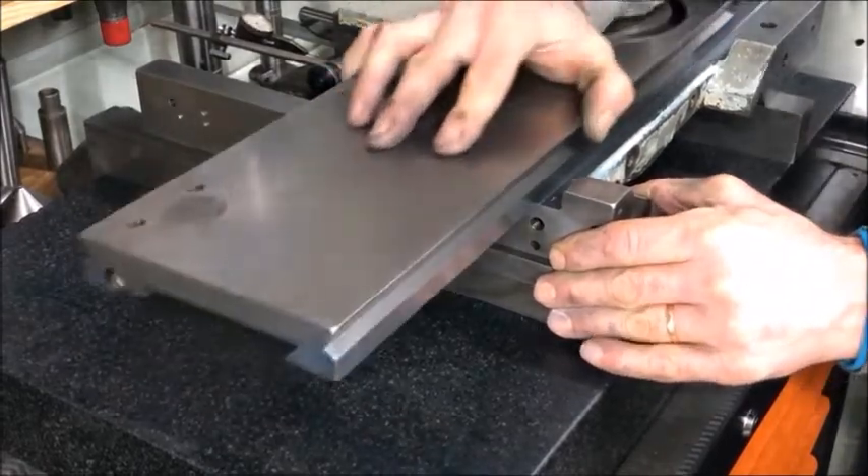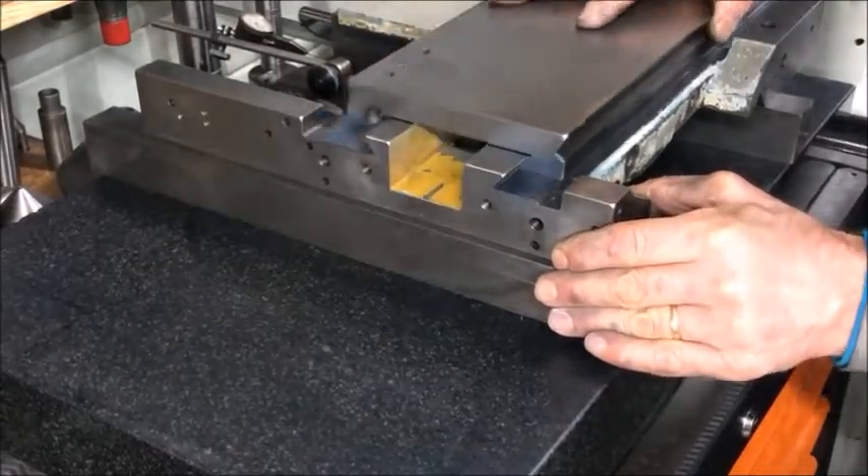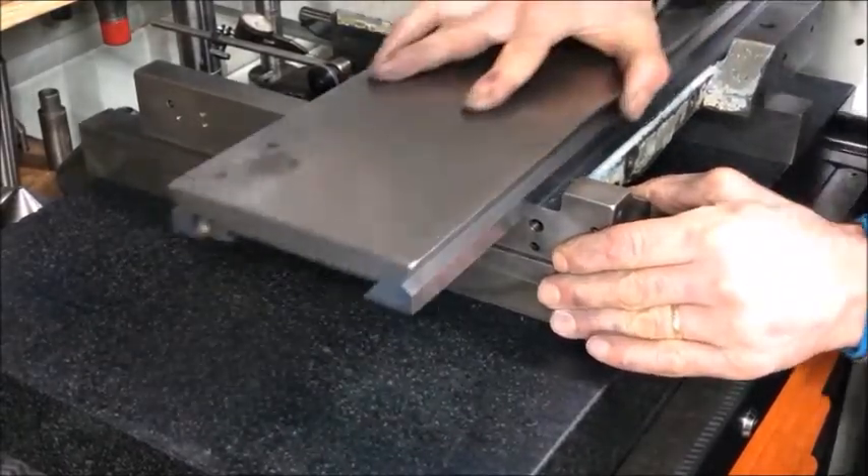As we will see, these reveal themselves vividly, and then you can start scraping just those to get the ultra-precision flat surface. As you can see, part of the surface here — searching for these shiny spots — you can see them here. These are then higher than the ones on the inside. They are also distinguished by the fact that they have a sort of a crest, a darker side to each spot, so they are easily identified. And these are the highest of the high spots.